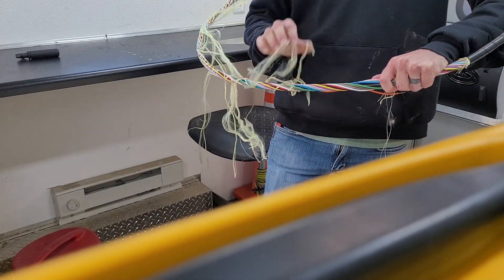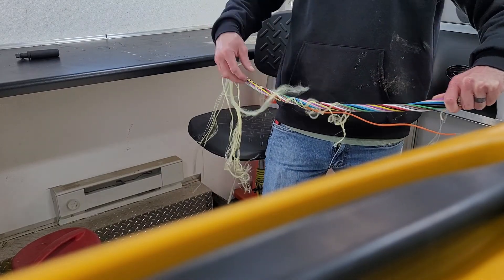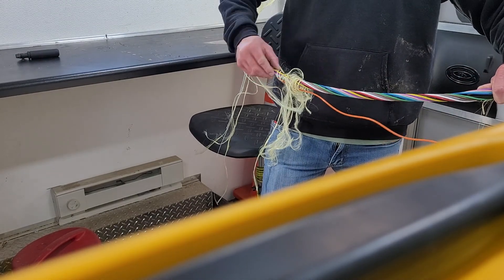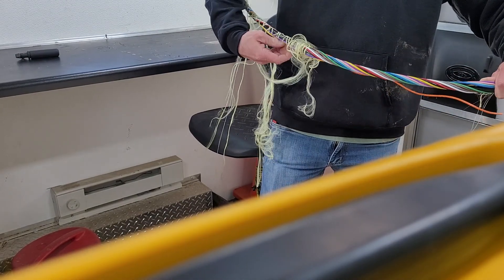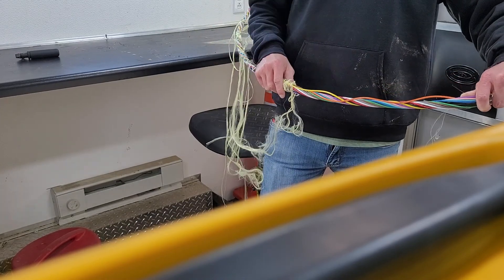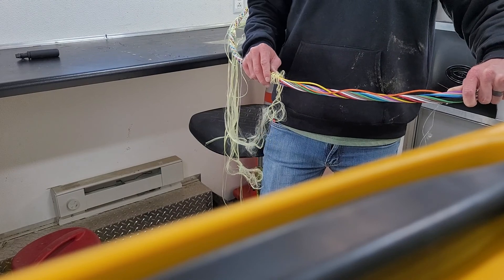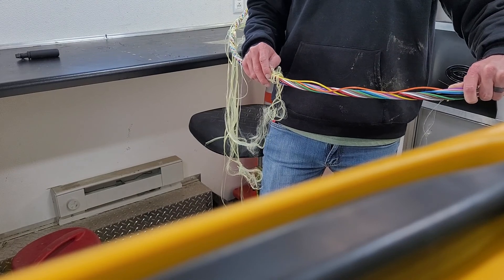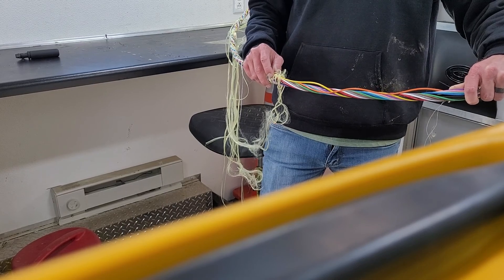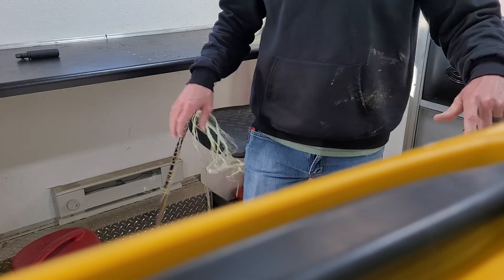If you're unfamiliar with fiber, you're probably thinking — well, how do I do anything with that? The way these are designed and twirled, there are sections of the cable that actually allow you to grab tubes and spiral them around in a circle. You can actually unravel those tubes. If you needed to access a tube, you could grab that tube right in the middle. There are also tools for that — to access the buffer tube just like you did the cable without cutting the fibers inside.